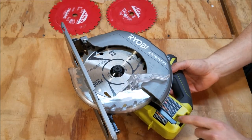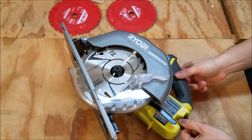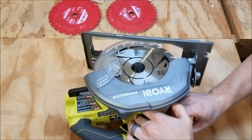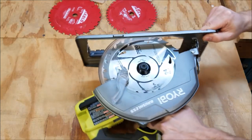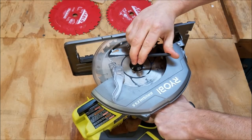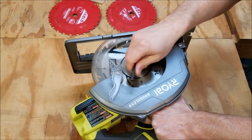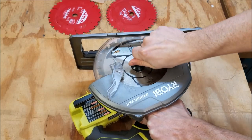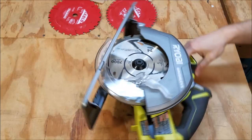To change the blade, the blade wrench is stored right here — it's really convenient, I never had to look for it. There is a spindle lock on this side of the blade guard. The easiest way is to make sure your battery is out first, then hold the saw in front of the trigger and push your thumb on the spindle lock. Then turn it with the blade's rotation to loosen. It's a little bit hard to find the detent on the spindle lock — the brushless motor has a bunch of indexing stops so you've got to make sure you have the right spot. To tighten, just turn it against the blade's rotation direction. Pretty easy to do blade changes with this.